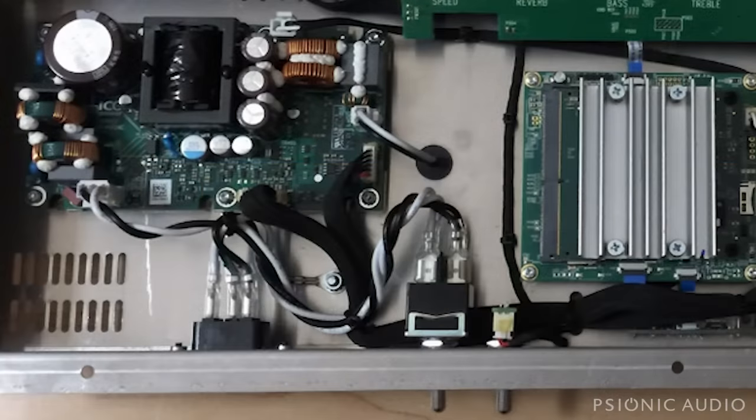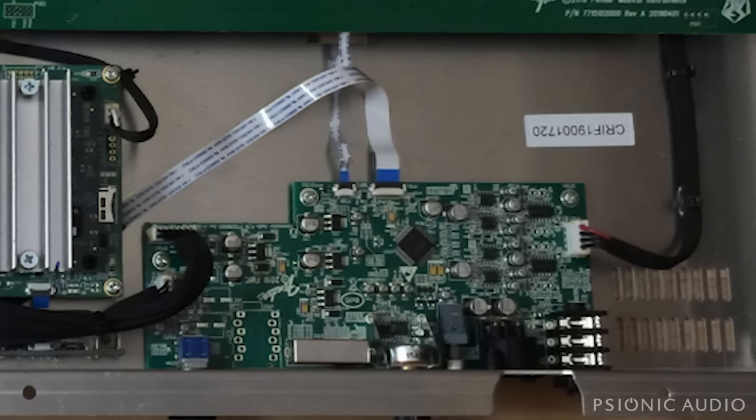The issue is the two remaining boards. On the lower right you're going to have the bulk of the amp circuitry - the preamp and output with the ins and outs. That is very proprietary - it's all surface mount. If it fails while the amp is in warranty, your Fender authorized service center can change that out. The minute the amp is out of warranty, if that fails, you're looking at three things: is that part still available, what it costs if so, and do they make it available to any tech or just Fender authorized service centers? I think as long as that board is available and Fender has stock, you'll be okay, though you may have to send your amp off to the next major city.